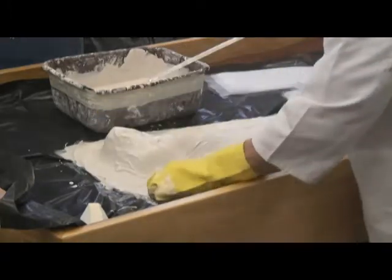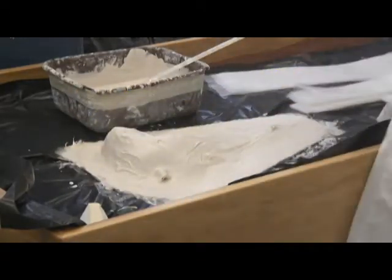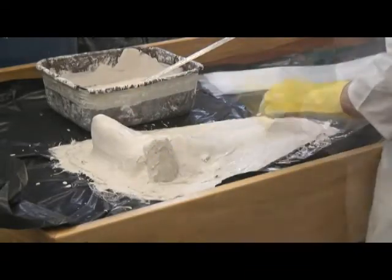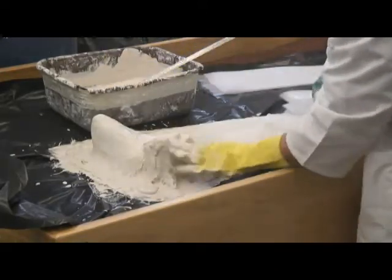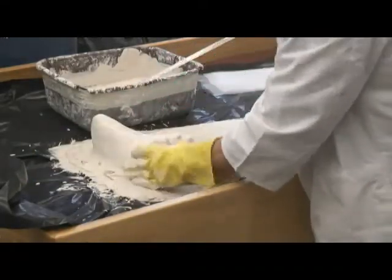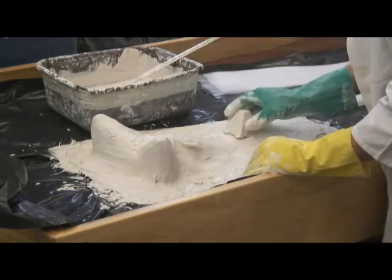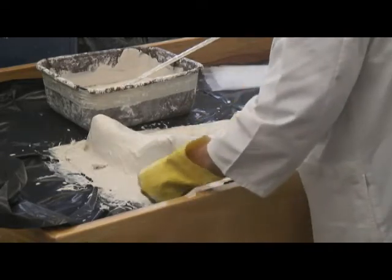Use 4-inch-wide fiberglass strips around the edges to strengthen the flange. Attach the feet with plaster, then stretch 6-inch square patches of fiberglass over each foot. Use at least 5 or 6 layers. Adding 4 or 5 additional smaller patches right on the tip of the foot would be even better, especially on heavier specimens. Remember, the tip of the feet hold the entire weight of the specimen. Cover everything with one last layer of fiberglass to hold all the patches together.